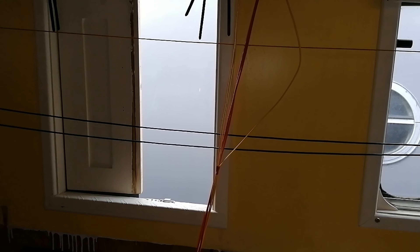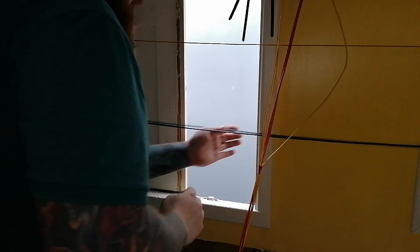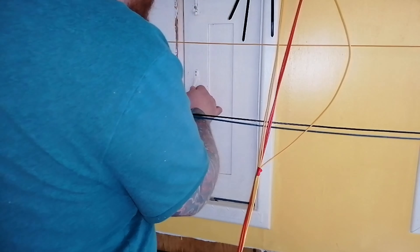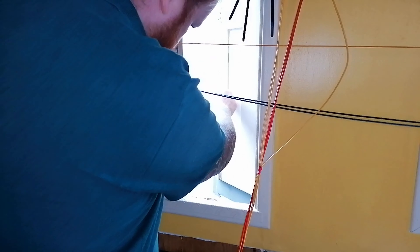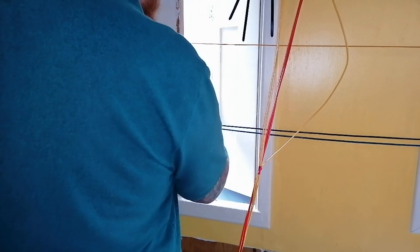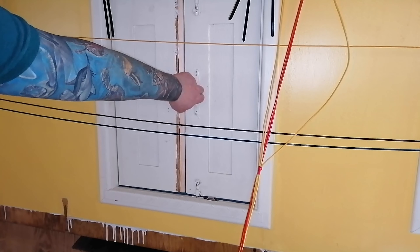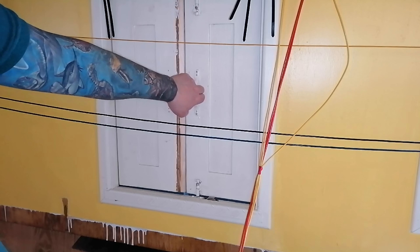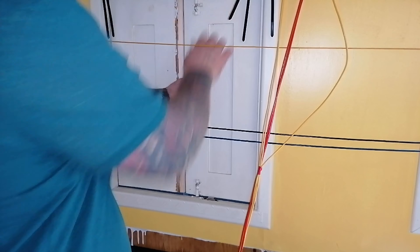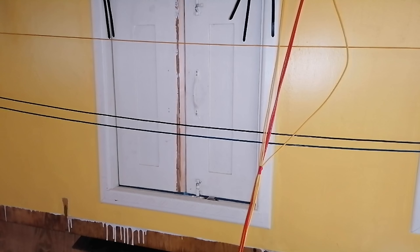All being well. I can get some wood filler in that now. Fingers crossed it will shut. I just need to take some off the top. I'm going to cut that down a bit. We've got less of a gap now - about 2 to 3mm. It's just not closing well at all, I can only shut one lock at the moment. So I'm going to take these out, put that rebate in, and get some new locks on it. Hopefully that will do the business.